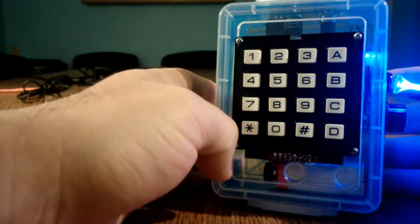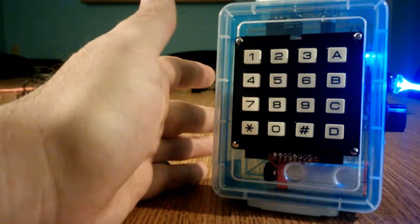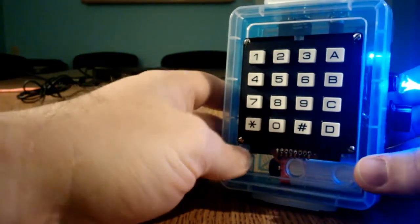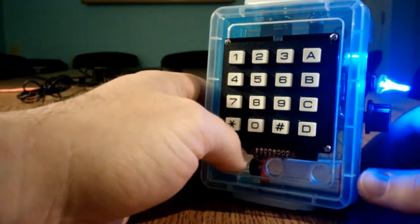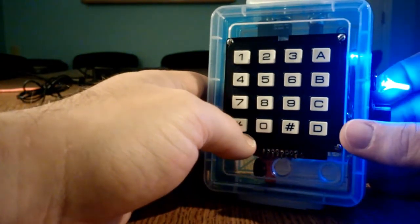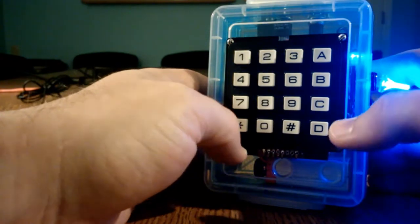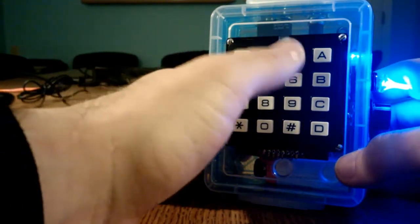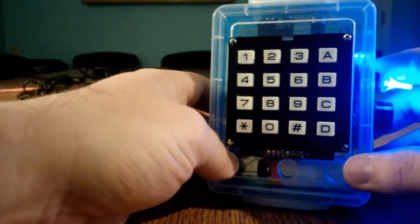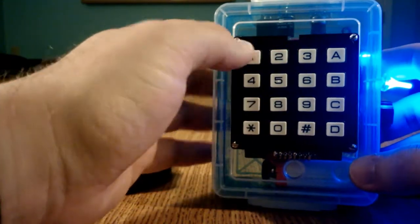I somehow stumbled upon this switching system, signaling system, while reading through the Wikipedia page for the Blue Box, and I wanted to learn more about it. I found a spec sheet, and then basically just coded it up really fast after reading through the spec sheet on the signaling switch itself. I had to figure out how each one of these buttons is encoded, and actually it's 35 milliseconds for a tone, and then 35 milliseconds pause, so each one is 4 tones.